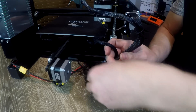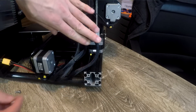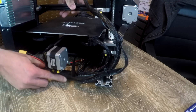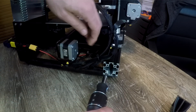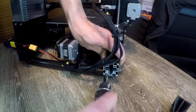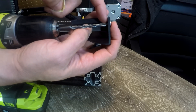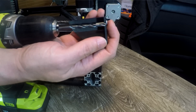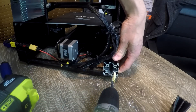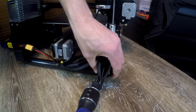The first thing we need to do is pull off the little cap over the extrusion, but then we realize our first problem: this part needs to be held on with two bolts, but the extrusion is not actually threaded. We prop the printer up and use an M5 bolt to cut the thread, since it's steel and the extrusion is only aluminium. We're going to drill it out but not to the entire depth — tape off the drill bit just a little bit from the end of the bolt, so when we drill and stop where the tape is, it leaves just a little bit of meat inside the extrusion. Then when we come back with the screwdriver and screw it in, it cuts the thread just on the tip and everything is retained quite strongly without requiring too much effort.